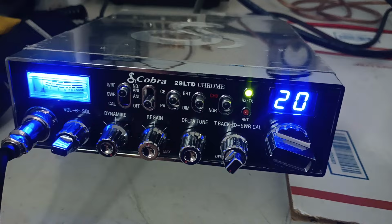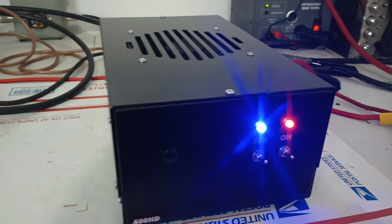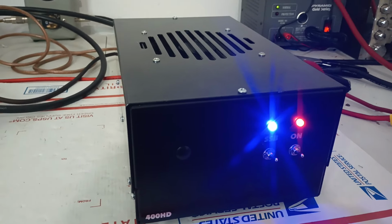We're going to hit it with about 100 watts PEP, 35-40 average. No, that's not the max drive it can take. It can take a little bit more than that, around 50 average or so, 125, 140 PEP, but we should see some good numbers out of it.